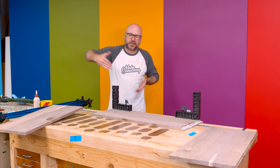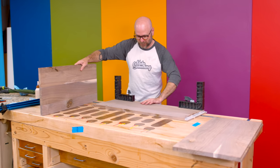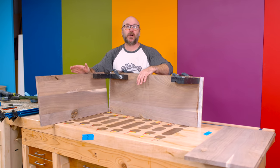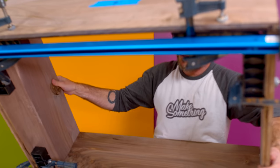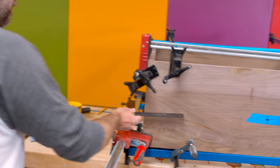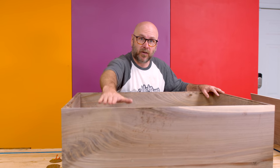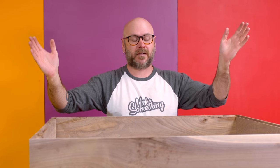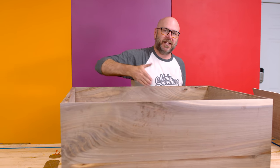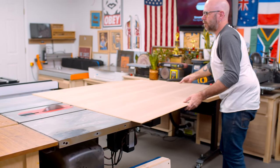This might be a little difficult because my bench isn't quite wide enough to get everything on there, and Dan's got to film so he can't help. I've got corner pieces here to make sure everything goes together square — I want this to be as square as possible because that's going to make making the doors a lot easier. Everything is square. The original plan was to do a shiplap back panel, but since I don't have a dado shelf in the middle, I want to give it a little more strength. So I'm going to use walnut plywood and glue it into the entire rabbet — that will give it a little bit of strength.